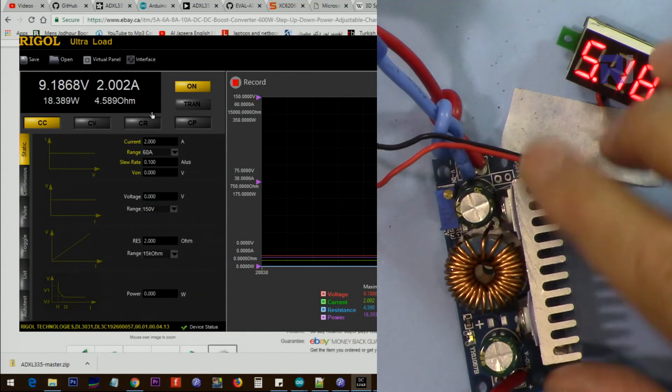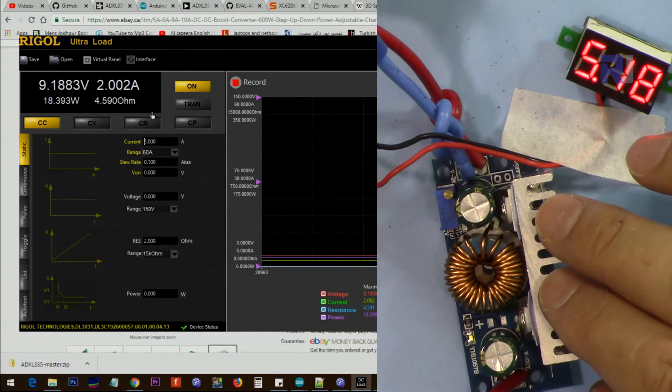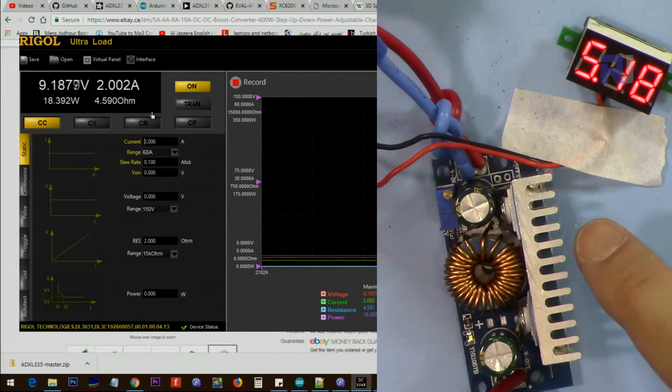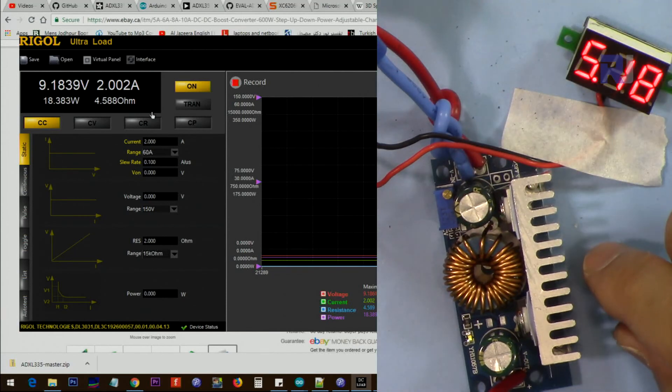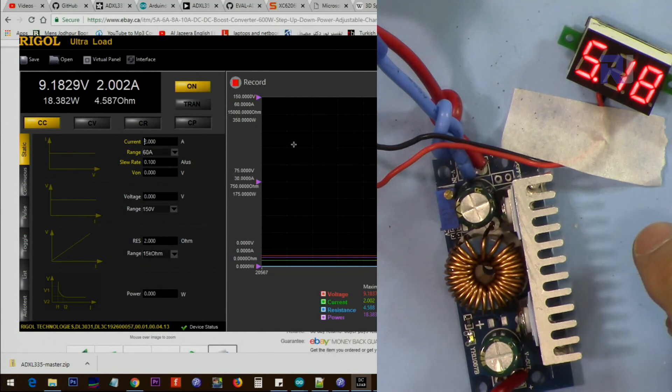In conclusion, this device is only a boost converter — you will not be able to use it as a buck converter. Whatever input voltage you have, the output must always be above that voltage. In terms of boost conversion, it will mostly give you one or two ampere very stably under the presented results. Otherwise you need to significantly increase the size of the heat sink or add a fan to continuously cool it down. Thank you for watching — this covered all possible combinations of input and output voltages. Please subscribe to get updates on upcoming videos.